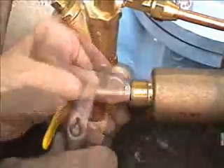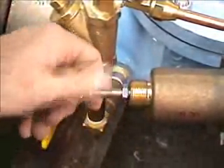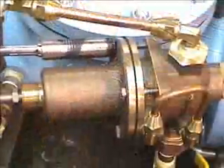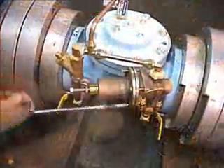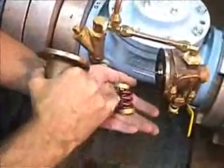First, take the black cover off the pilot, loosen the jam nut on the adjusting screw, and back out the adjusting screw enough to take the tension off the spring. Now you're ready to remove the four cap screws that hold the pilot bonnet on the pilot. When you remove the pilot bonnet, you'll find a spring with two brass or stainless steel spring retainers on both ends of the spring.